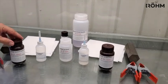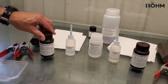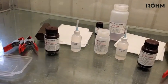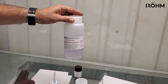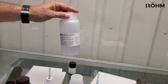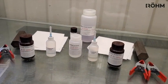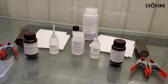The benefits: solvent cement is quicker and has less labor, and gives you a nice strong joint. The downside of a solvent cement is the potential for bubbles in the joint. The polymerizable cement is what people use for aquariums and also for museum vitrines. The benefit is that it can give you a nice bubble-free joint and it is also strong. The downside is that it is a very labor-intensive joint — it takes a long time with a lot of sanding and buffing to get a nice pretty joint.